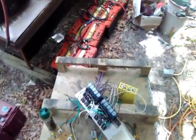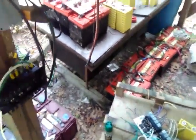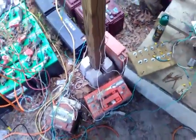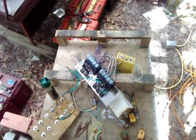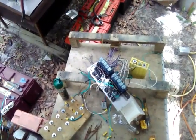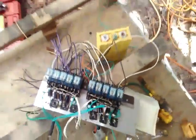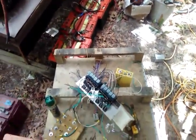The nice thing with solar panels is that when you load them down, they don't care how far you load them. You can take the whole 300 volts of solar panels and load them into a 12-volt battery, and as long as the amperage doesn't push the battery's voltage too high, you're fine. My problem with the relay setup was that somehow in the switching from one to the other, if one relay didn't switch fast enough, it would burn out the relay. I even had capacitors and diodes across there to try to help, but in the end I decided to try something else.